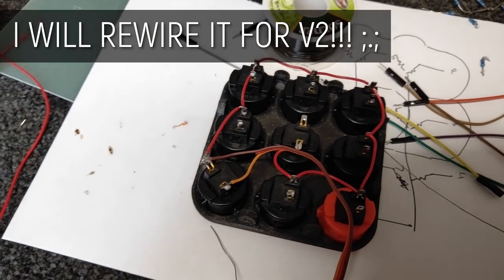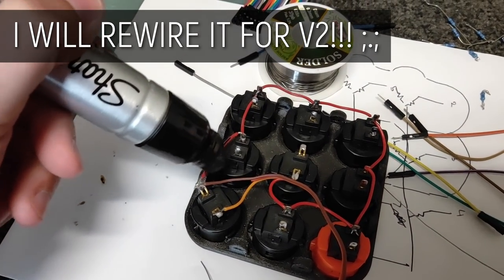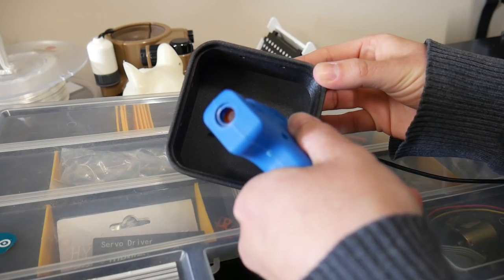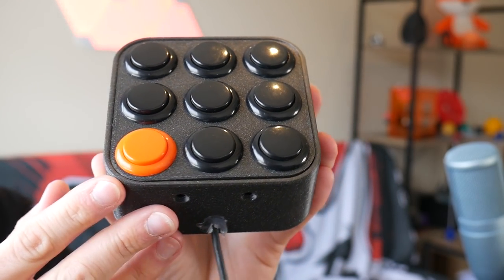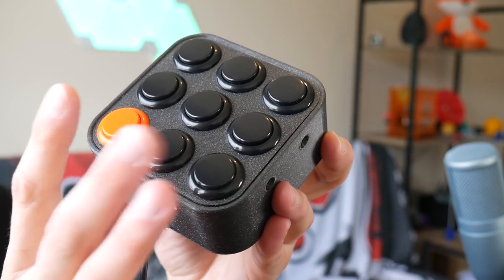The reason the red wires are now marked with black is I went from using external resistors to using the internal ones, and therefore they just go straight to ground via a red wire. Let's pretend that doesn't exist and never speak of it again. With the top on you wouldn't know it looks horrible inside. For now I have a micro USB cable connected to the Pro Micro, hot-glued for strain relief. For version two I'd like to order a micro to USB Type-B adapter — they come from China so they take about three weeks — to get a more durable USB connection like the actual MIDI Fighter 3D has.